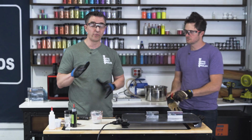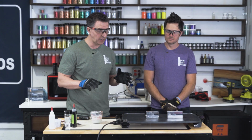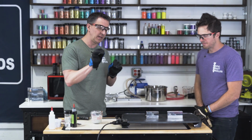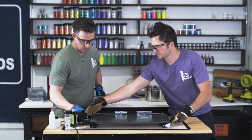Yep. So this is just about perfect. It's right around 340, which makes for a very nice pouring temperature. I usually try to open pour between 340 and 350, just so I have a nice thin stream. You want to help me move this over? Yep. That over. There we go.